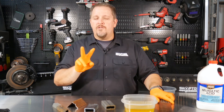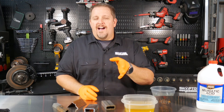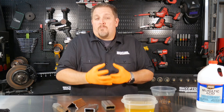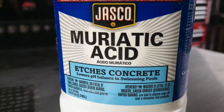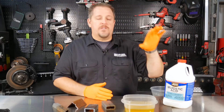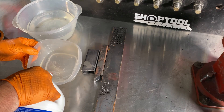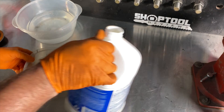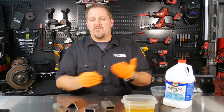You can get one of two things. There's probably several things that'll work, but as far as what'll take off the mill scale and the rust — one easy thing is white vinegar. White vinegar is not quite as corrosive; it takes a little longer. The other is muriatic acid. You can find this not only in the big box stores, but also at your pool stores. It may be a little cheaper and you may be able to buy it in bigger bulk as well. Be extra careful with this — it's not so much that it gets on your skin, which it will and it might burn a little bit.